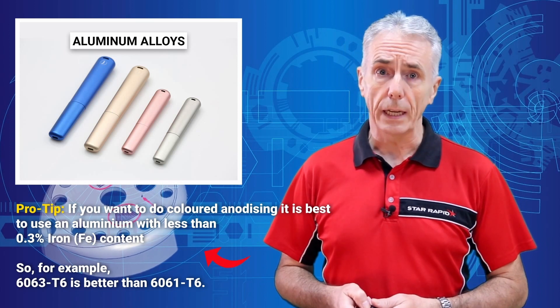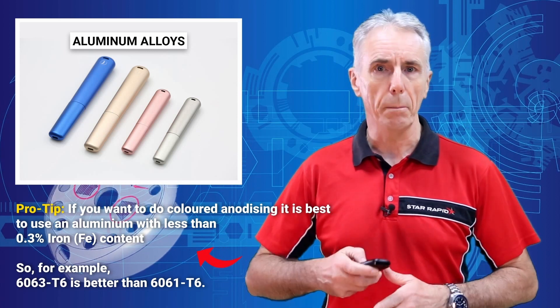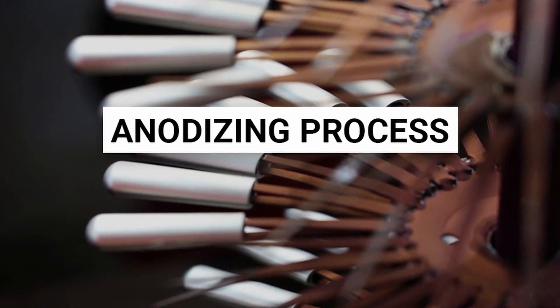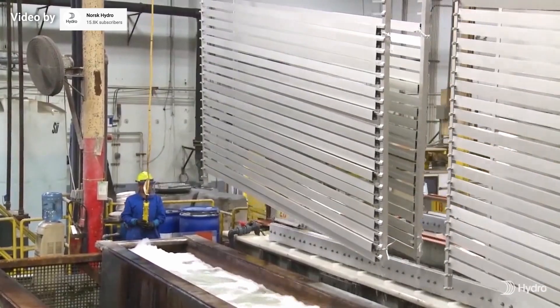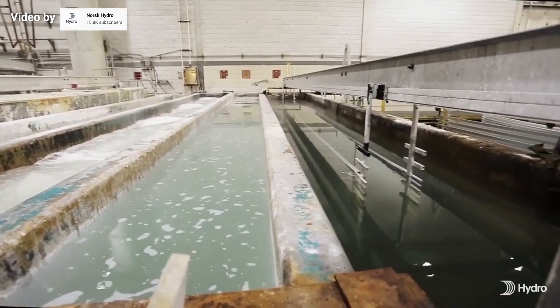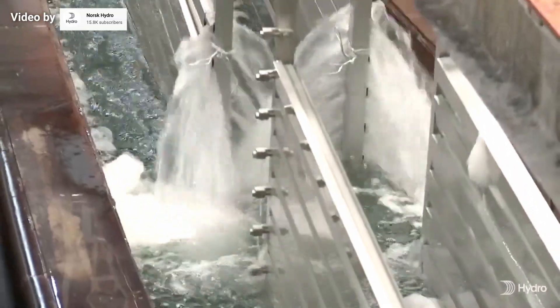There are some other limitations that developers need to be aware of, so please pay heed to the following insights gleaned from our many years of anodizing tens of thousands of aluminium parts. First, the part is thoroughly cleaned, rinsed, and surface etched. This requires several baths in a variety of detergents, acids, alkalis, de-smutting agents, and pure water.